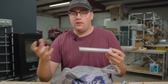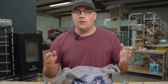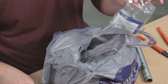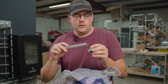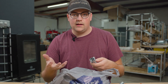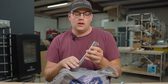EMT conduit is a rigid pipe. It can be bent with a hand tool — we've actually done a video on how to do that for beginners. There's also a type of conduit called FMC, or flexible metal conduit, designed for specific situations where you've got to make back-to-back bends or get wires to a location that's just not accessible with solid conduit. This adapter basically allows you to connect half-inch EMT conduit on one side — it uses a set screw — and the other side is an adapter for flexible metal conduit that clamps around it. So you can continue your cable run from solid conduit into flexible conduit.